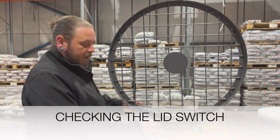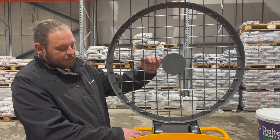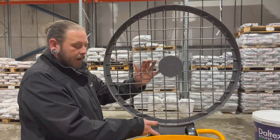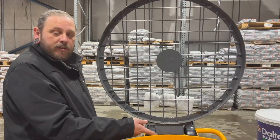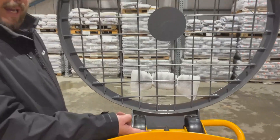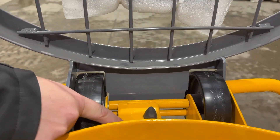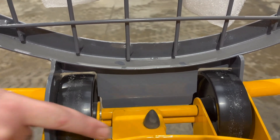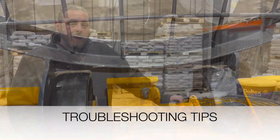Fitted to your Baron mixer is a mechanical end switch. This means that when you lift the lid of your machine, it will stop the movement of your blades. This needs to be free and clear at all times and able to be moved. If this is packed down, wedged, or forced into position with resin or any other material, clear the debris and make sure that you've got free movement to ensure good action on your lid switch.